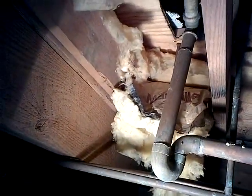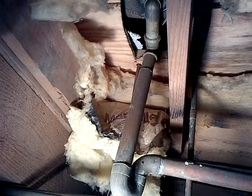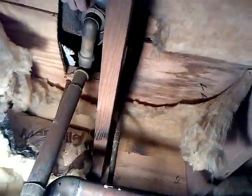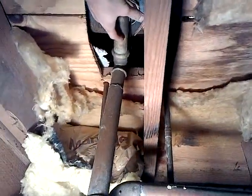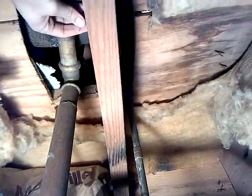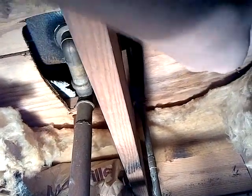This point here is the entrance. We're underneath your house, and here's your bathtub area. You have a hole going up into your subfloor right here — this is definitely letting a lot of cold air seep into your house. If we were to seal up the crawl space, we're going to need to close this up and seal it properly. This is definitely letting a lot of cold or hot air in.